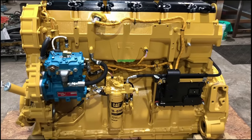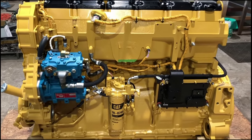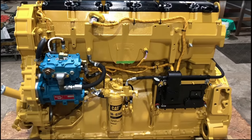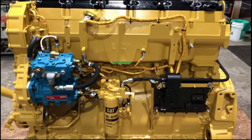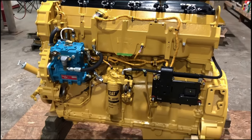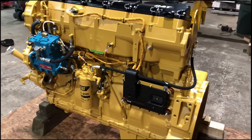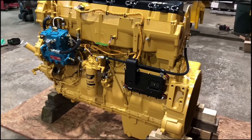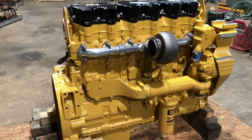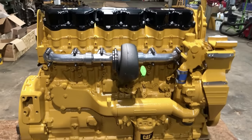So you'll be able to take a regular old 14.6 liter E model, or you know, 6NZ or MBN C15, and convert those to a 5.71 inch bore too, using the stock 14.6 liter crank. And that brings them on up to somewhere around 16 liters of displacement. I don't know the exact figures, but it's somewhere pretty close to 16. And of course, any of those kits are to be used off-road only.